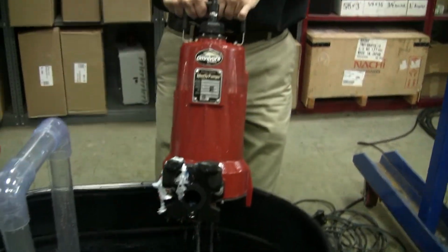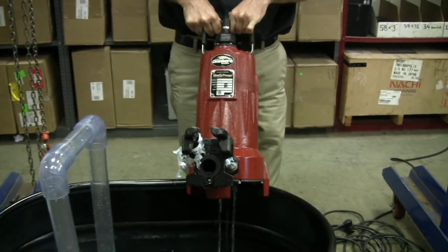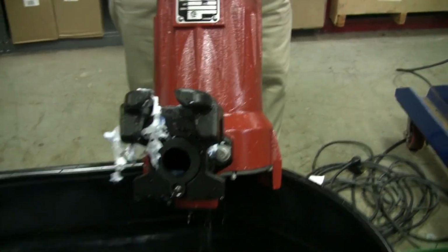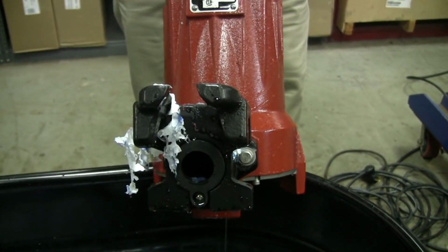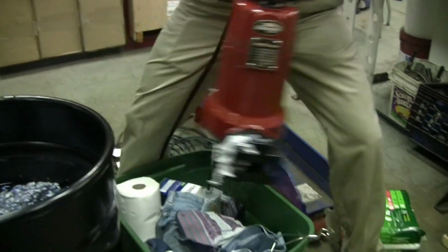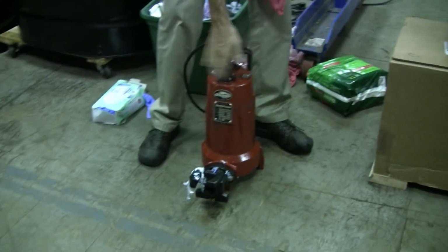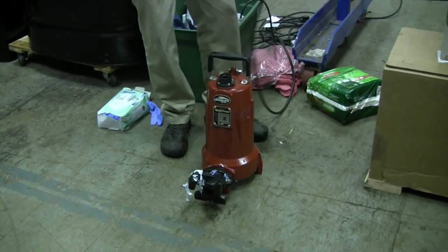This is the disconnect system here. I just pulled it off the guide rail. It's that simple. It has this big heavy claw here and this rubber grommet that seals its seats off on there, so that's very easy. That will actually seal a two-stage pump, that simple. So if I want to service it, I'll pull it out, set it on the ground. So in the field, you'd put a wrench on there and pop that off. Okay, there's your quick disconnect cord feature.